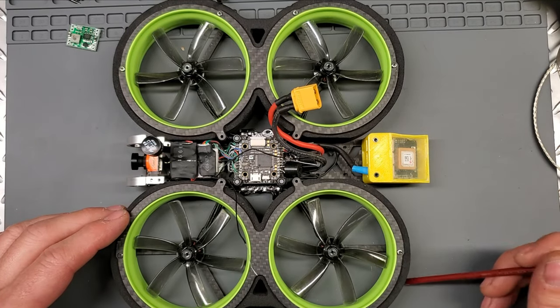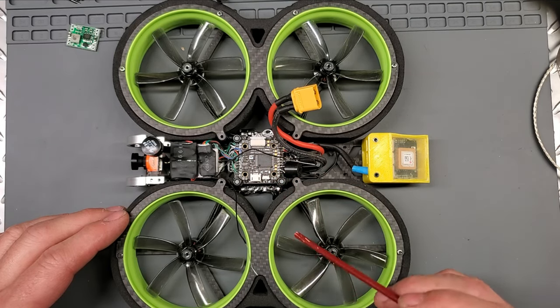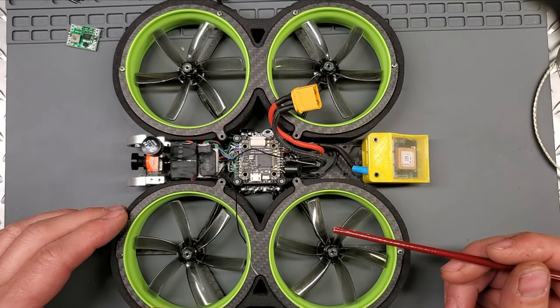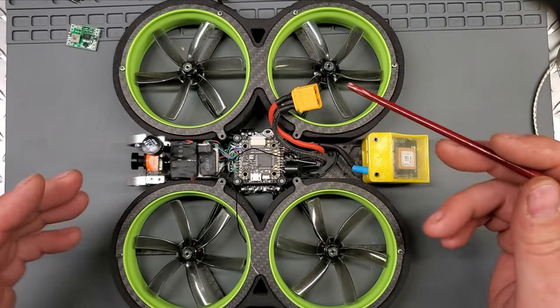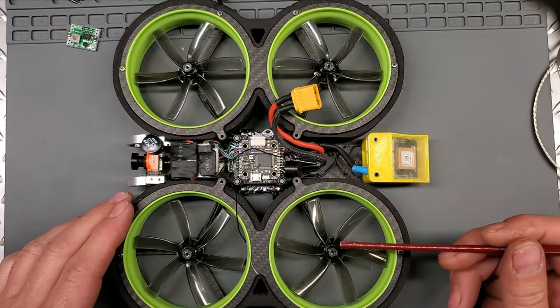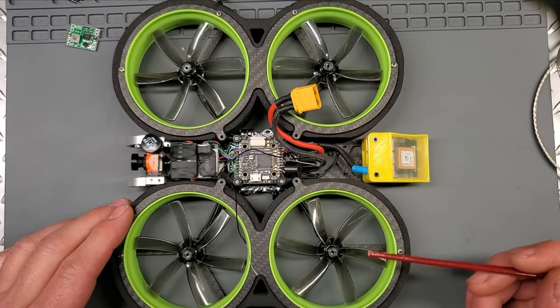I would highly recommend this unit. Make sure you have a flight controller that INav supports. It has a target for it. Does not have a barometer on it. Maybe have a black box. Black box is very important. You have your little beeper here, even though you can't hear it with how loud this thing is. This is the loudest beeper ever, and yet I still can't hear it over the top of this racket that this thing makes.